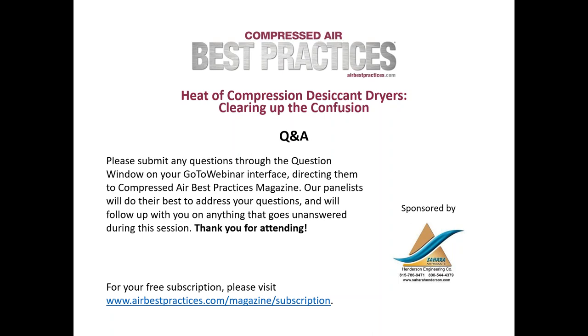Okay. This next question is for Mr. Henderson. The question is, can heat of compression dryers deliver negative 100 degrees Fahrenheit dew points? Absolutely. We need to look at the design conditions, and depending on your regeneration temperature from the compressor, we may need to add supplemental heat. We'll have a trim heater on our stripping line. We may need to add a trim heat exchanger and use chilled water, but we have a variety of heat of compression dryers delivering better than minus 100 all over the world.